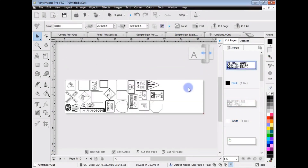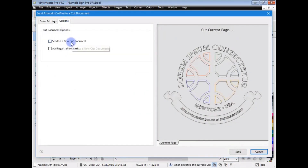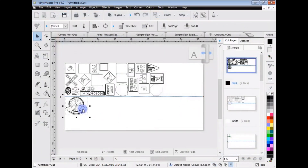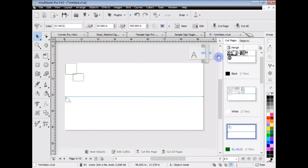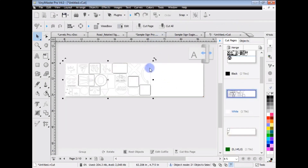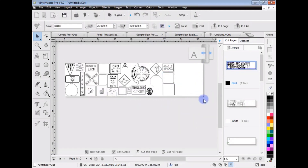You can append to or add to your cut files. So if I click here, I've got this sign I want to send. I come here and click Send a Cut File. One option is to start a new cut document, but in this case I want to add it to my existing cut document. I click Send and you can see it automatically sends the black, white section, and green bit. I can press Nest and it attempts to save media, adding the job in - the white section and then the black. You can see how it saves time, and I can add to this cut file, save it, reopen it, and recut it any time I like.